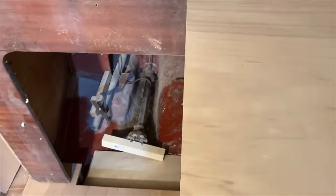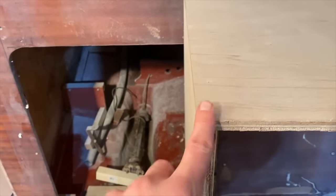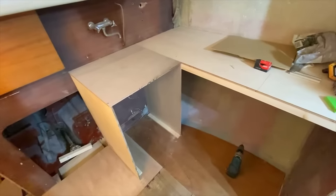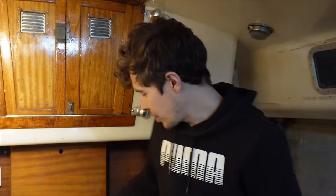There's a little overhang here which I did on purpose just to confirm the right size. The worktop will probably overhang as well but we haven't decided what we're doing with the companionway yet. I've extended the galley top — it took a lot of fiddling because there isn't a straight edge on this boat. I always cut a little longer or shorter than I think I need to, then trim it down to get it perfect. We've got a box that's completely symmetrical so we can get drawers in. Tomorrow I'll do the same on the port side — deep drawers that will look great. The gimbal, sink, and taps are all arriving.